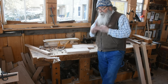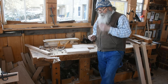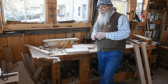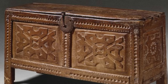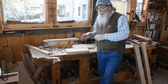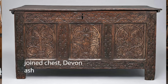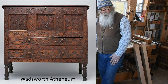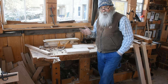Yes, you can use sawn wood. No, it doesn't have to be oak. There are frame and panel chests from Pennsylvania, early 18th century, done in walnut. There are ones from the same period in what is now the southwestern US — New Mexico — done in pine but frame and panel mortise and tenon. There is an English one done in ash and a Massachusetts one done in maple. The notion — frame and panel, the mortise and tenon — it's adaptable to all kinds of timbers.